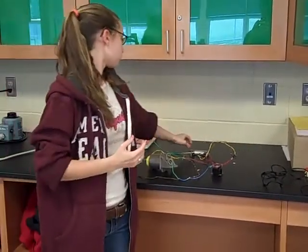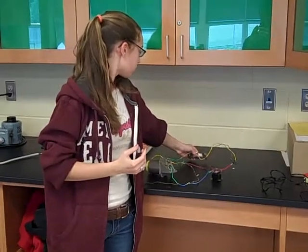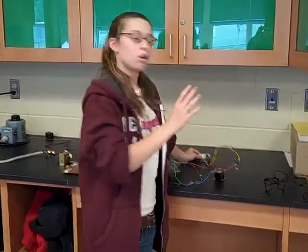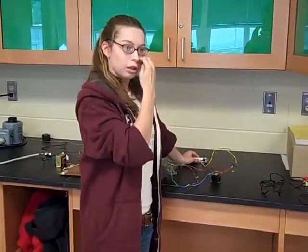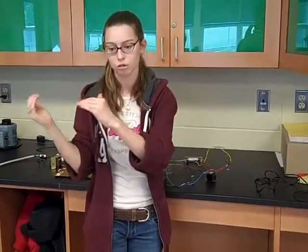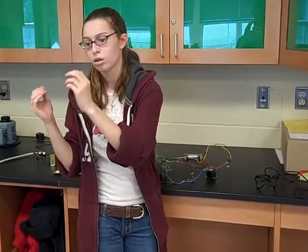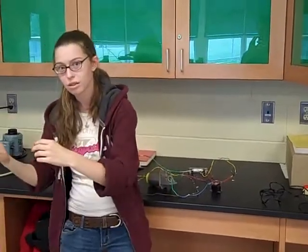The way a laser works is it's got mirrors on either side, and it's almost 100% reflective on both sides. One side, however, is slightly less reflective. The idea is that by having mirrors on either side in the direction that you want the light to be traveling, the more photons you get going in that direction, when one photon hits an atom, and it will create another photon, and it'll bounce in exactly the same direction.